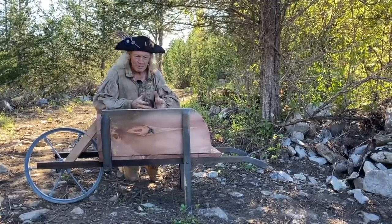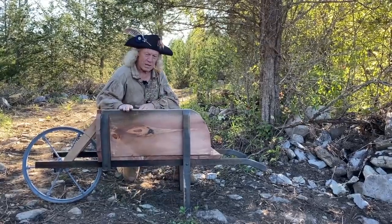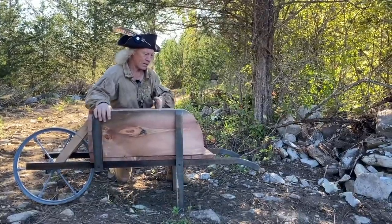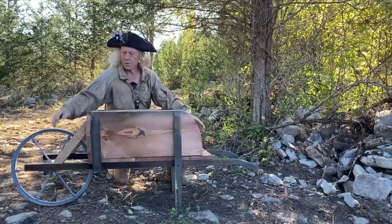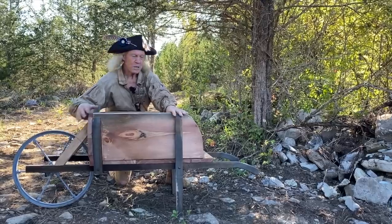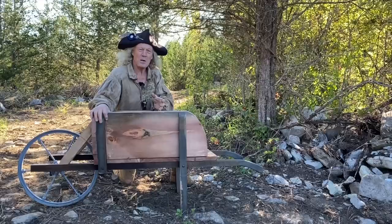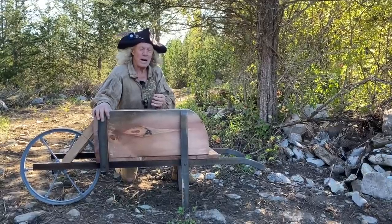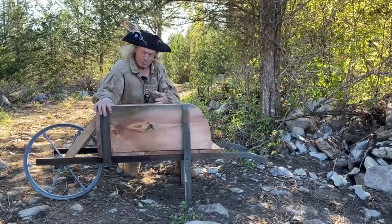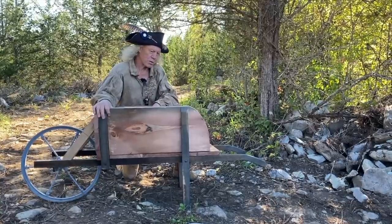And it's working great. Just full disclosure, I used perfectly white, brand new sawn white pine for the box, cherry for the structural members here, and here. And I put on just plain white vinegar with a bunch of iron filings from my modern blacksmith shop mixed in with it. And basically it etches it. It's sort of like using aqua fortis on a gun stock.